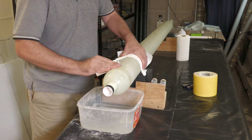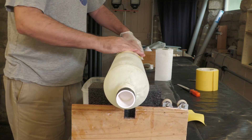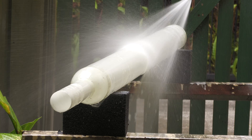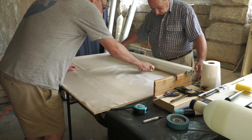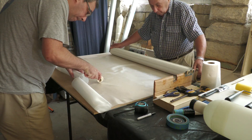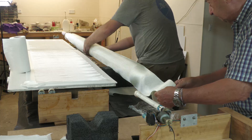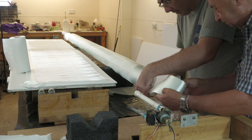With just over two weeks to go before launch we need to sand down the rocket. We're using wet and dry sandpaper to keep the dust down and prevent the sandpaper from clogging up. To get any fine particles off the tube we just hose it down. Next we prepare a two-meter long strip of thin fiberglass cloth — this will be the outermost layer that makes sanding easier and gives a nice smooth finish. Next we thread on the biaxial fiberglass sleeve, cut to length but always leaving a little extra even though the sleeve will stretch when pulled tight.